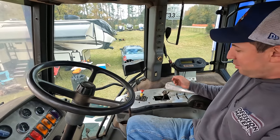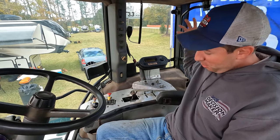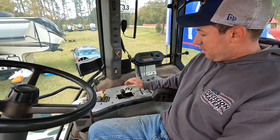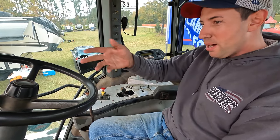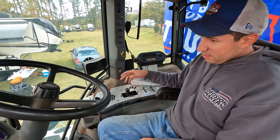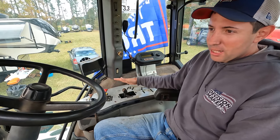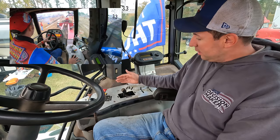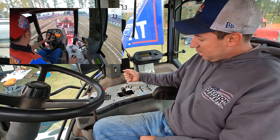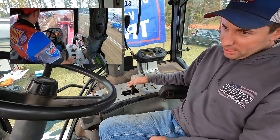In here is where the magic happens. You've seen pull videos before over my shoulder — I'm riding down the track with this black knob pushed in. That is the box drive clutch. It's hooked to a safety cable up front that the box will pull out when it gets to the front, in case the electric-over-air solenoids happen to fail. There's a spring hooked to the cable, and when the box tops out it will pull this out as a failsafe to keep parts from breaking. Riding down the track we bounce around a lot, so I'll have two fingers just holding it forward so the cable doesn't get tight and pop out.